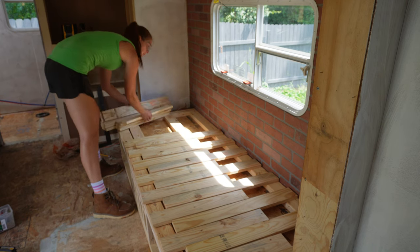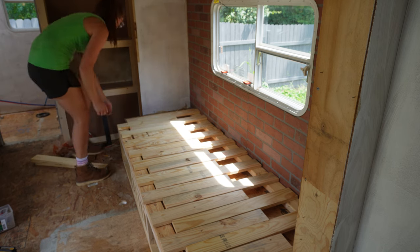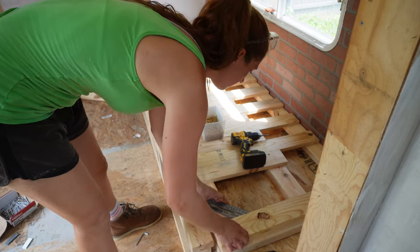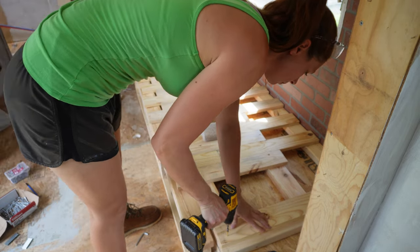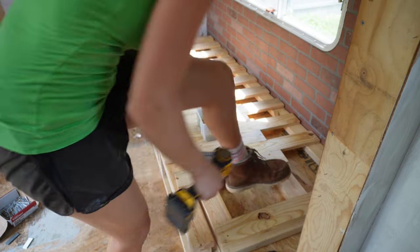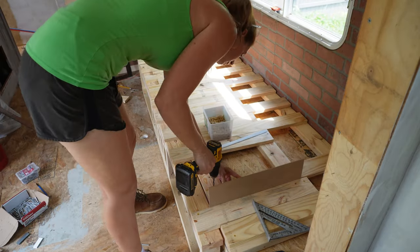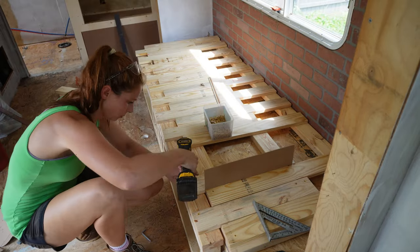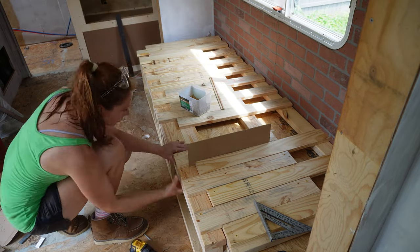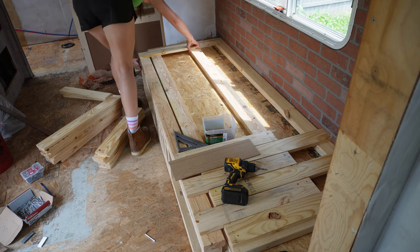As you can see, I'm basically just alternating these pieces right here — these are going to form the slats. The 22-inch piece is the one that slides out and attaches directly to the frame on the floor, and then the longer piece spans the entire length of the slide and is a stationary piece that acts like a guide for the others to slide in and out. This first piece is very important to get square, because if you don't, none of the others will be square and it won't slide properly. What I did was get a scrap piece of eighth-inch paneling and stick it between each slat so the spacing is the exact same going all the way down — that thickness works really well, not too much of a gap and not too small.